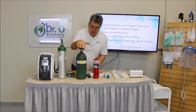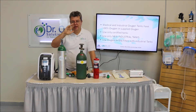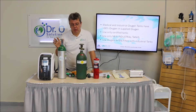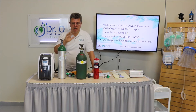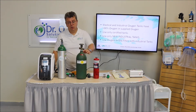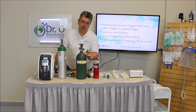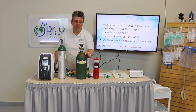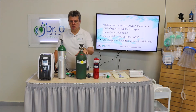Please buy new tanks. As far as industrial tanks go, do not go to a welding store and buy old tanks — they will try to sell you old ones. Buy new tanks; they are available and cost about $80 for about 20 cubic feet. Extremely important: make sure the tank is certified, with the certification mark right on the top showing how long you can use the tank.